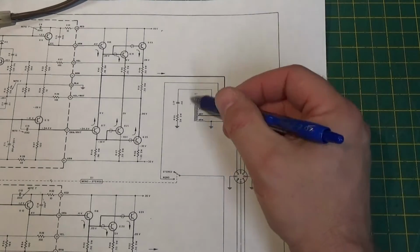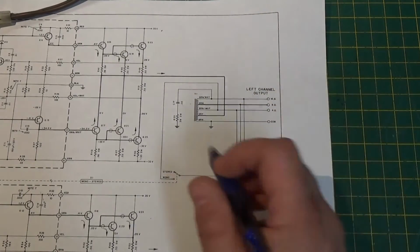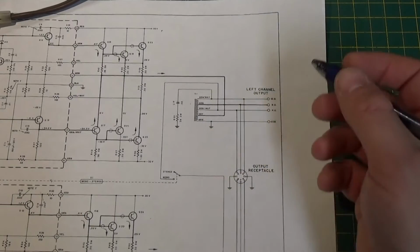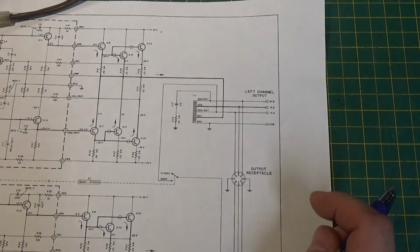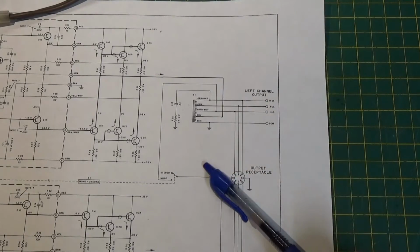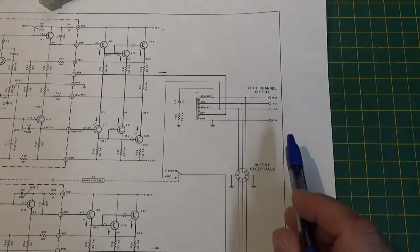So on the P237, this transformer, the windings are a little bit different. It has more turns on it that boosts that voltage up, and then once you go across your long distance line, let's say it's a PA system, so you're distributing the sound throughout maybe a large building or a store or something, and then at each point you want to put a speaker, you would put a step down transformer, which is a small little transformer, and it's going to take that 70 volt line and step it back down to 4 or 8 ohms, and then go to a small speaker, and you can put many of those on there.